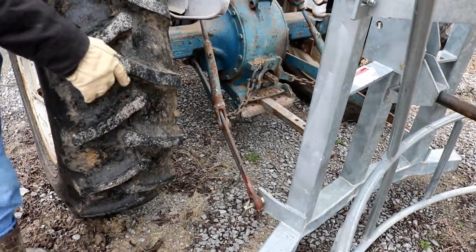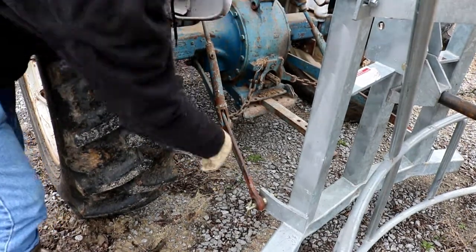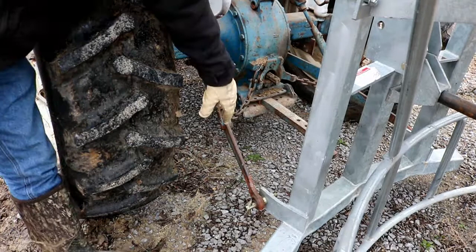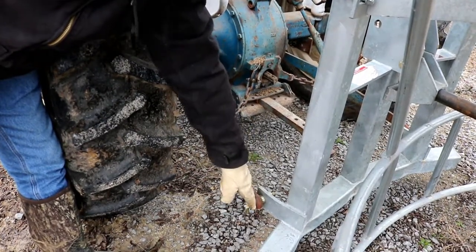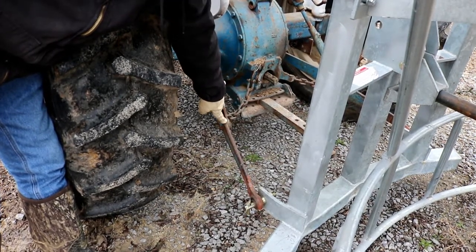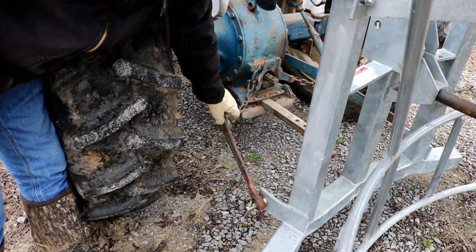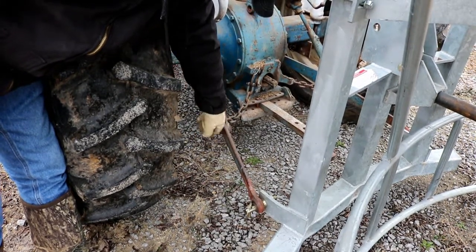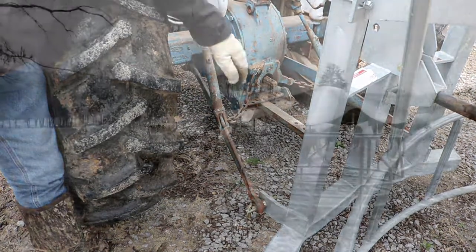Now, one place to really get a lot more lift height on the tractor is the three-point arm itself. Some tractors have an extension here where you squeeze or pull a pin and extend the arm out, or where the actual lift arm attaches to the three-point arm, there will be a pin that you pull and move the lift arm to a further out location, pin again, or further in. But that's one place you can get the most lift height the easiest.